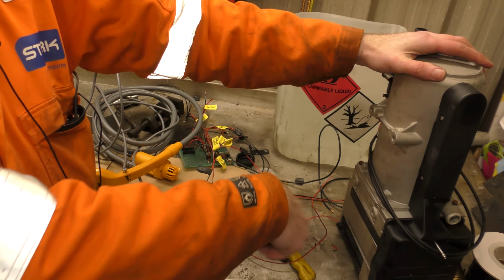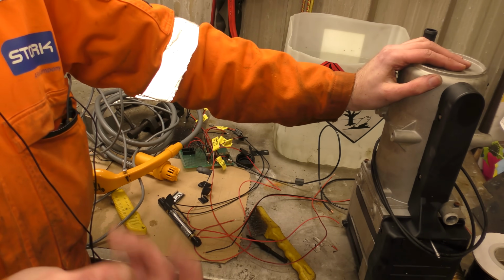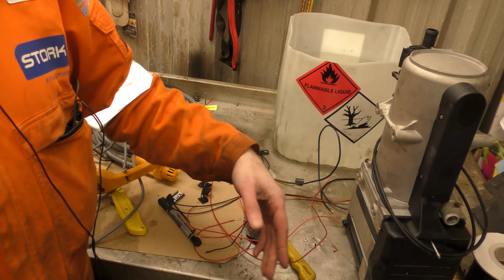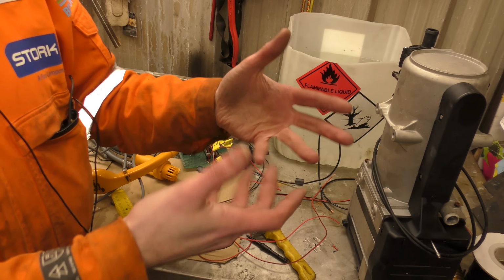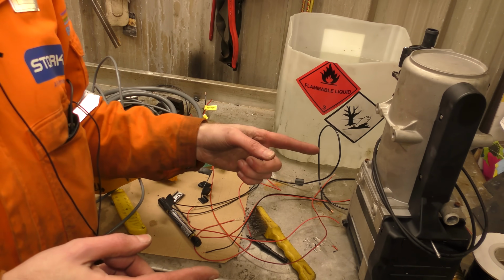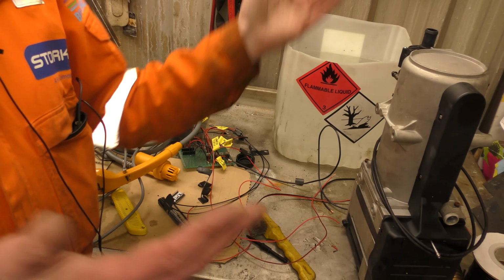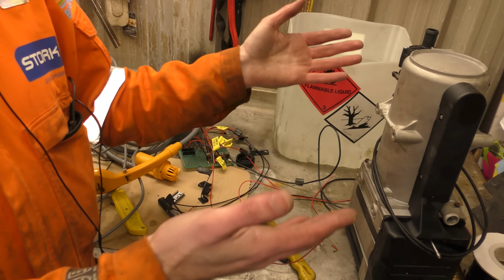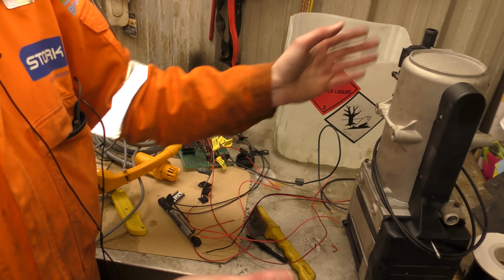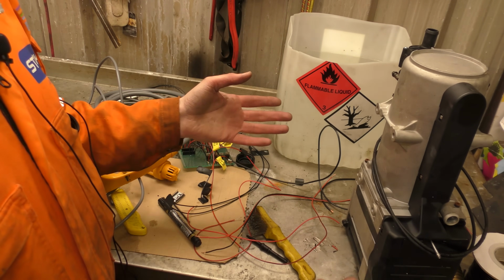The Chinese 16 kilowatt, 8 kilowatt, whatever actual output we measured it at last time, that totally works. Mains feed in, hot water out, variable pressure showerhead, Bob's your auntie, lovely biscuits. The smaller Webasto also totally works. Mains pressure in, adjustable showerhead, hot water out. Obviously you get less flow because it's a smaller heater, so it can only heat up the water to probably about half, or not quite half, but it works anyway for Webasto.